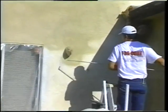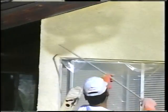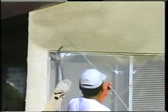It was introduced by stucco manufacturers more than 70 years ago to even up the color on new stucco and to mask discoloration caused by improper application or uneven drying. Stucco contractors quickly learned to use fog coat for the final detailing upon construction completion. It covers cracks, chips, discoloration, stains, cement splatters, and other imperfections, leaving a uniform color over the stucco surfaces. It looks like new stucco. It's not a paint cover-up.